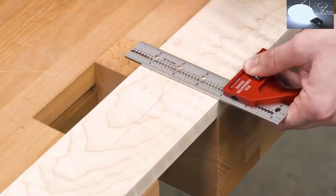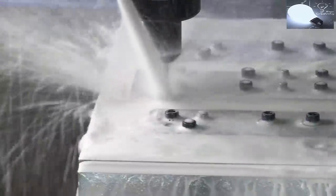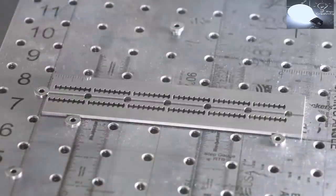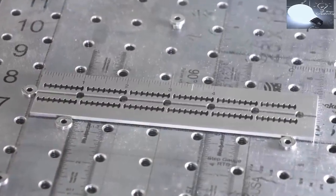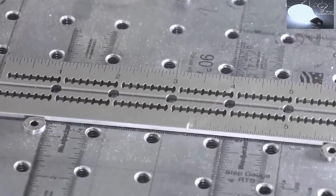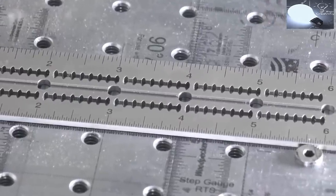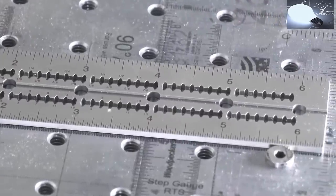The stainless steel blades go through a multi-step process to give them a non-glare satin finish. The scales are laser engraved to an accuracy of 4/1000ths of an inch over the length of the blade. The laser engraving process actually changes the structure of the steel a full 10/1000ths deep, so you'll never rub off or wear through the graduations.